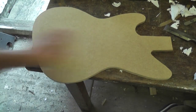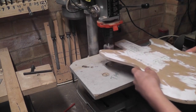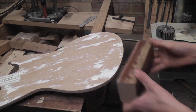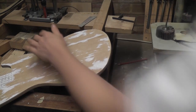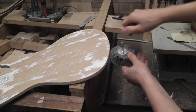While I've tried to pull the paper off, it's stuck down in places — it's not an issue, I'll just route it upside down and have a nice flat surface to route on. To get into the tight curves, I even used a small sander. To finish it off, all I do is take a sanding block — this is just 40 grit — and run it along the edge of the body, trying to keep it square to the side, not rocking it either way. That's basically going to take off the high spots made by the round sanding, where it'll only touch one small part at a time.